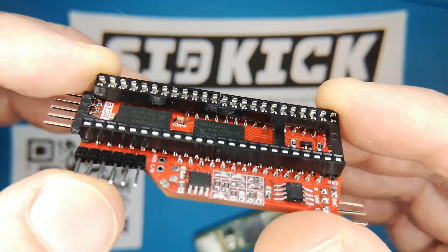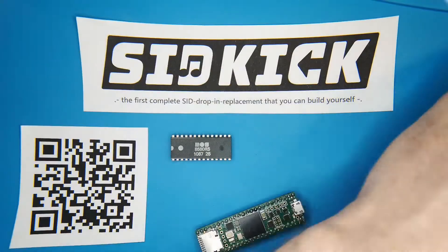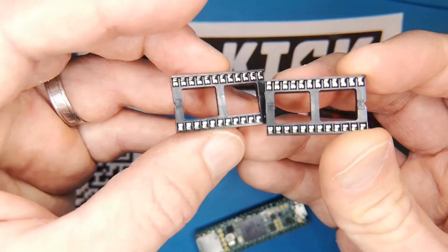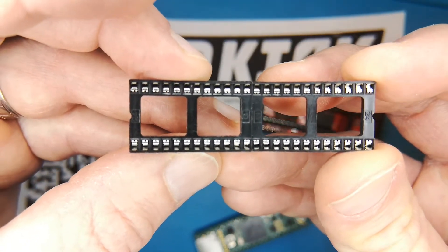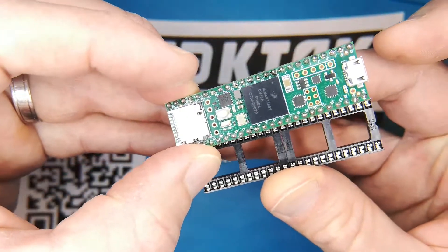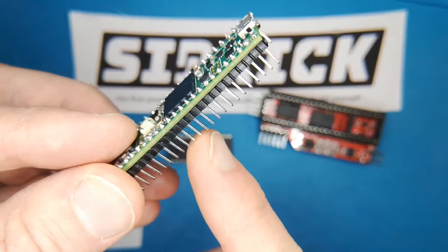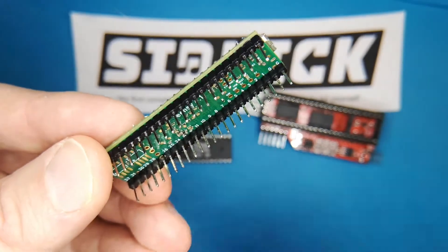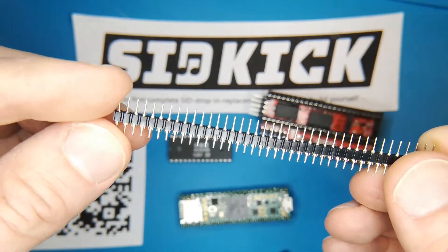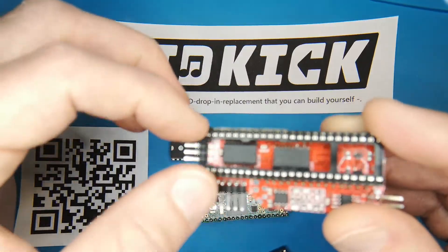This order might really depend on what parts you want to use. I used two of these sockets to get a socket where I can plug in the Teensy — which I already had legs soldered onto it. These are not rounded pins, which is not perfect, but it still does the trick. For next time I would use rounded pins, especially as I use those sockets here which go much better with rounded pins.